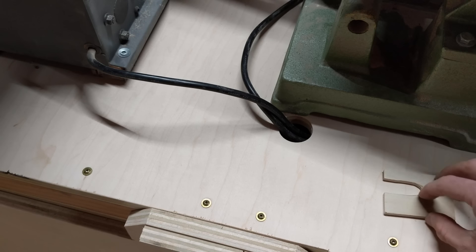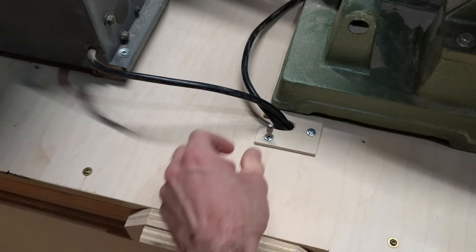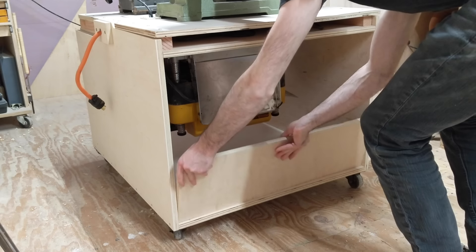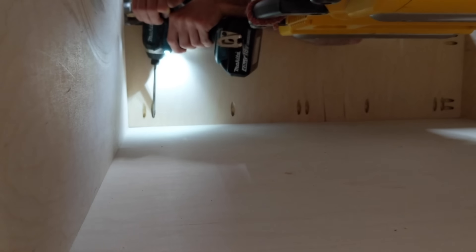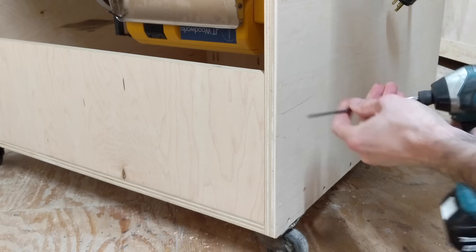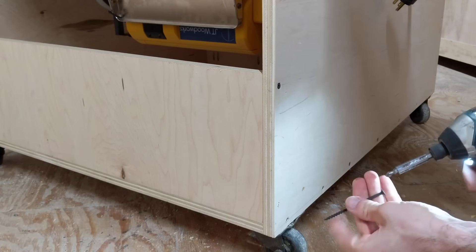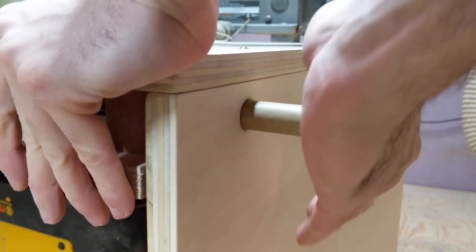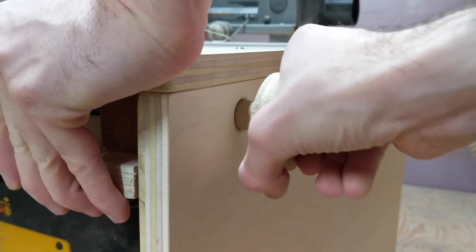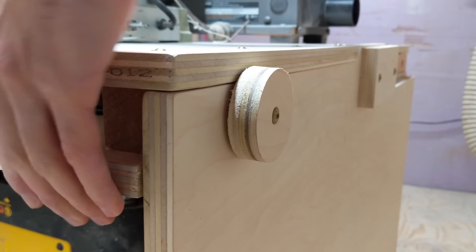I made these small covers to help keep dust from getting into the hole and potentially being a fire hazard. With all of this weight and movement, I needed to add some pieces to help with stability and keep the entire thing from racking. I added a piece of plywood on the front and back using pocket holes to screw it down into the bottom and using long three inch screws directly through the sides into that piece. It would have been best to add these earlier in the build, but I wanted them to be as tall as possible without interfering with the tools as they flipped around. The last thing to do is to drill a hole through the side into the 2x4 support so I can add a dowel to act as a lock to prevent the top from flipping around, and I added one of these to both sides.